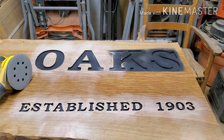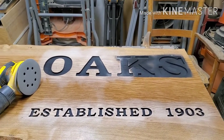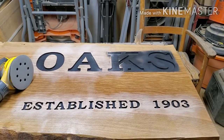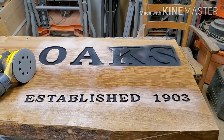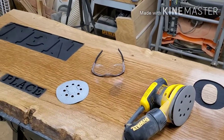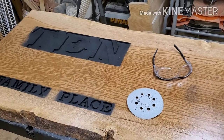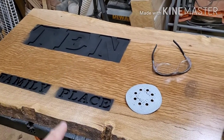What I want to do in this video is talk about how I prepared this oak slab to get all this black ink applied without any bleeding into the wood. What I did was lay down three coats of the Helmsman polyurethane on the whole board, which really brightens up the grain.